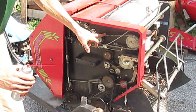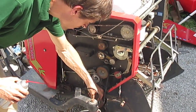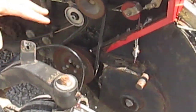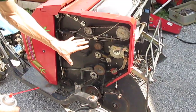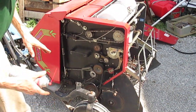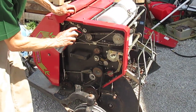However, there are some other chains in here. There's a chain that drives the pickup wheel to pick the hay up off the ground. Those chains receive no lubrication — it was too congested in there for them to run additional oiling lines to those little chains. Besides, those chains aren't doing nearly as much work as the big chain. So once a year, when the side panels are off, these chains have to be lubricated.